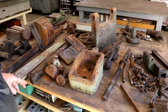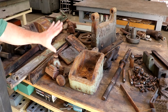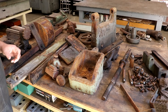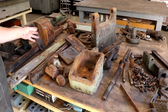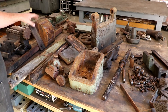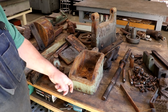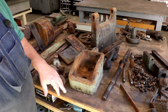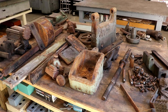On machine surfaces — for example, this is the trunnion. This piece fits into this piece and is what the table tilts on. It's a nice machine surface and I really don't want to put that on a sandblaster because it's going to pit it and it may not move as smoothly. So this piece probably won't get sandblasted at all. On the inside of this other piece, I'll sandblast carefully but stay away from the machined inside surfaces and clean up what I don't get with the angle grinder and wire wheel.